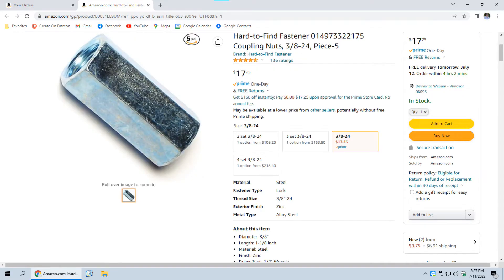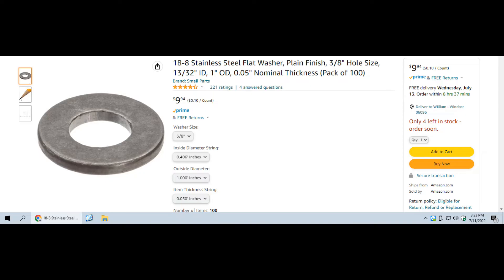Next were the couplers. The couplers are the funny ones — they're longer, they look like nuts but they're really long. They allow you to make the connection between the actual bolt that's inside the box and the hamstick on the outside. Those were bought from Amazon. You also need a bunch of flat washers to connect things to and to give the lock washers something to bite into so you don't damage the nylon. Those also came from Amazon.